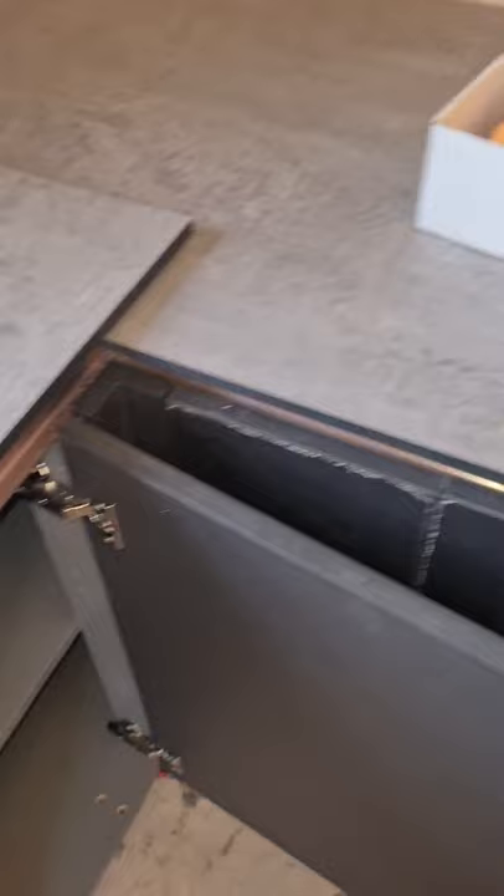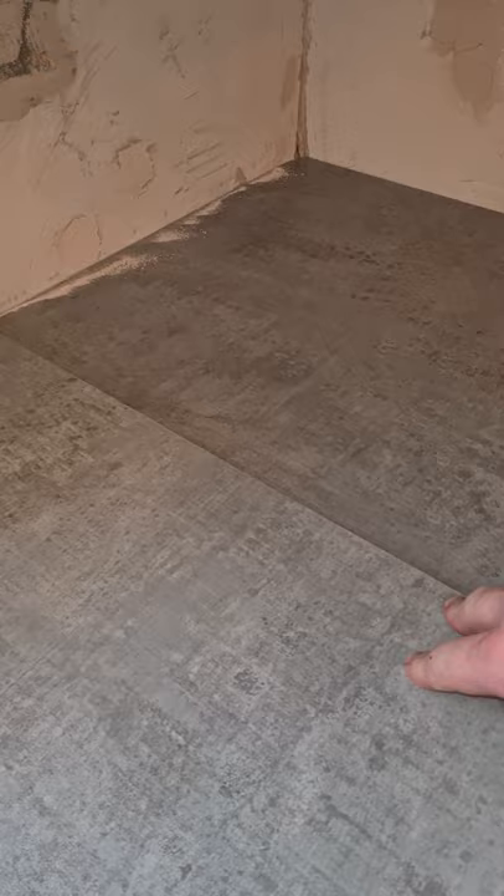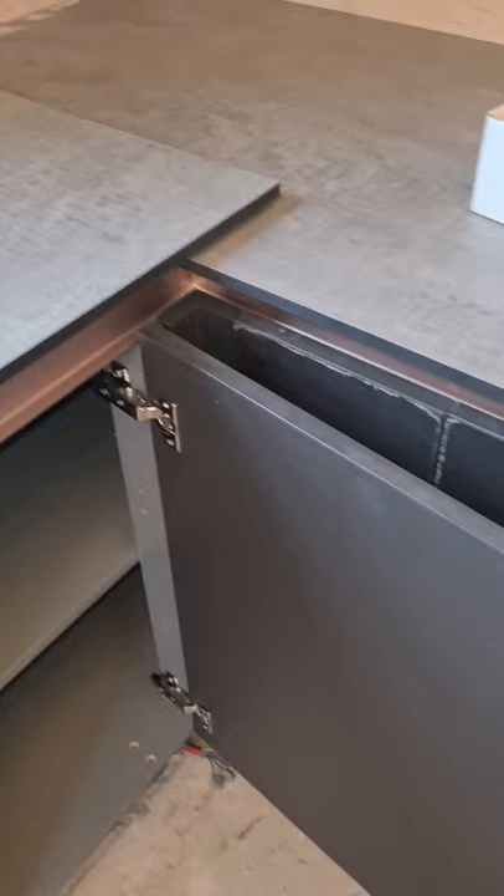Now I've got to mark the underside here. Looking at that cabinet, I'm going to mark our scribe line, which is where we're going to have to cut this worktop so we get a clean butt joint. Make sure you've got a sharp pencil — mine's a bit blunt — so we get a clean line.